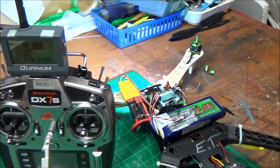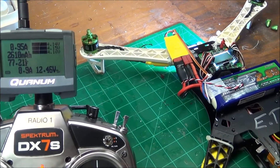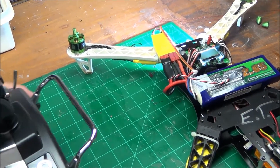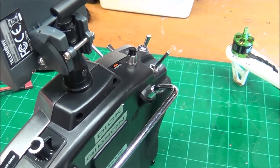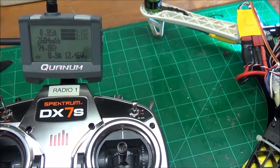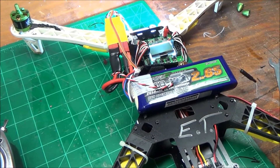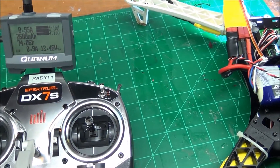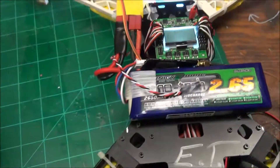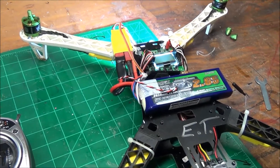It does have an alarm — haven't had it go off yet. It operates on 2.4 GHz, and there's lots of discussion on Hobby King's page about how it could work sitting on top of a 2.4 GHz radio — we'll see. It fastens onto the antenna with a couple of metal clamps and can pivot, so if you've got it on a tray you can turn it and still see the screen. Right now it's showing nine-tenths of an amp draw because I've got two big lights on the front, and earlier the temperature sensor was reading close to 90 degrees on those LED lights.